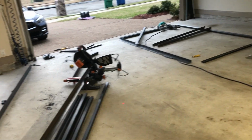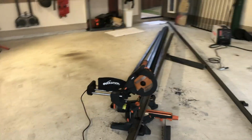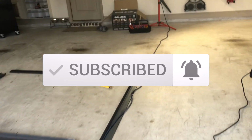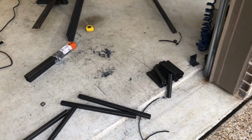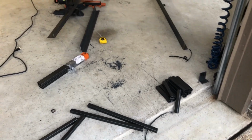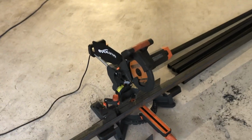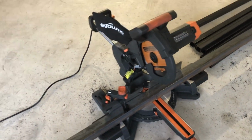I was going to tell you about the blade. So, multi-purpose blade, I kind of figured it would not do any one thing real well. So the orange blade that came on it, as I figured, wouldn't last that long. But I cut all of this up. That's some 3/16 there. So cut all of that up. Cut up this thin 16 gauge stuff was very easy to cut, of course. But I made a lot of cuts in some thicker metal with the blade, but the blade is done. I needed to make about 2 more cuts, 2.5 more cuts. It got halfway through this thing and it quit. It would not cut any longer.